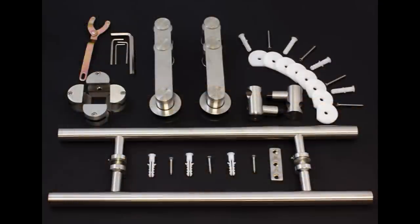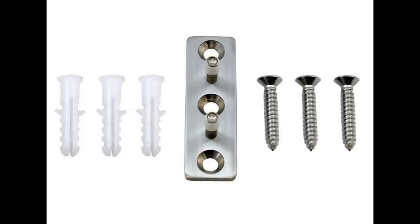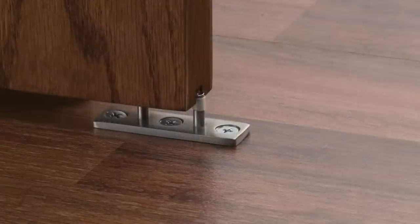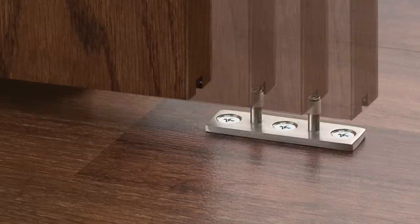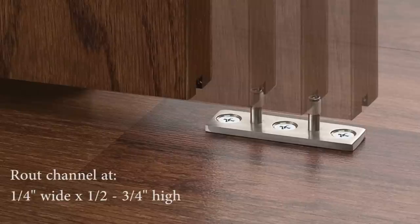Here's a look at the hardware. First, we'll start by prepping the door. A floor bracket is provided to help the door stay on track and prevents it from making contact with the wall. This means you will need to route out the underside of the door so it can slide over the bracket. The bracket is three quarters of an inch high overall, so in order to have the door slide freely over the posts, a channel needs to be routed for the length of the door at one quarter inch wide by one half to three quarters of an inch deep, depending on your suspension height off the floor.